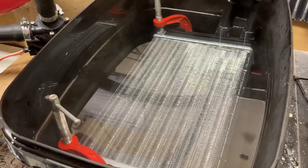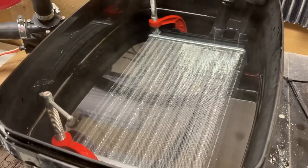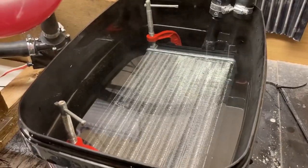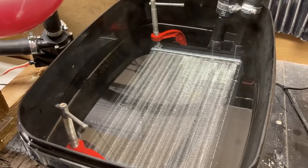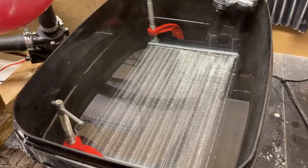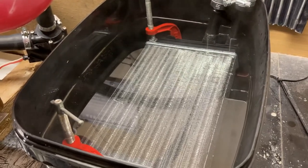There is an issue with getting over 60, is it 60, 65 degrees to kill viruses and various germs, which your tank needs every now and again for the pipes and all that kind of stuff. But I won't be using the diesel heater to bring the temperature up. The water tank I'll be using is going to be a plastic tank, which will go up to 70 degrees C. So therefore I can raise the temperature enough, probably to be cheeky, 75, 80, to kill any germs off every now and again. But that will be done with a 1000 watt 240 element that will be fitted into the tank, like an immersion heater in a house, which can only be done on the hookup.